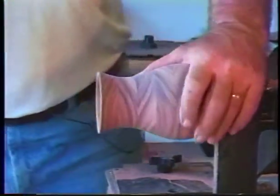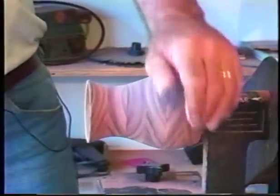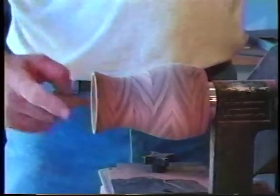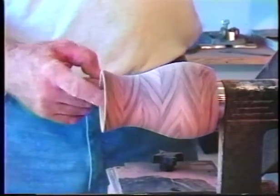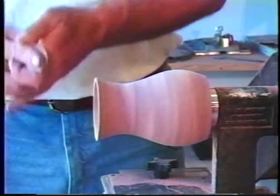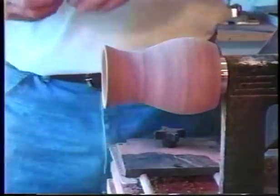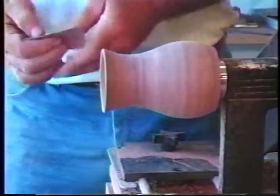And now you stop it, look, now that looks good, and I got a nice even thickness on the outside. Now what I'm going to do is, because I was sanding there, that edge has become a little bit sharpened again, so I'm going to, from different angles, again round that off, and then the outside portion do a little bit more to that.